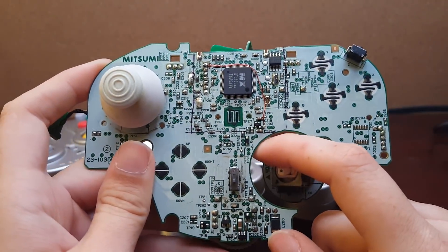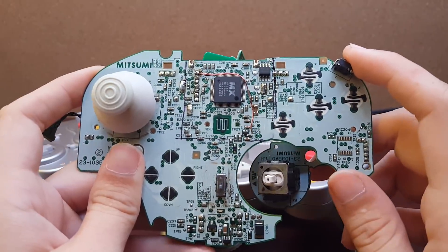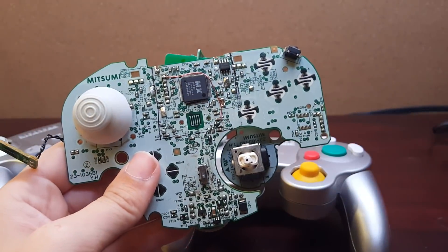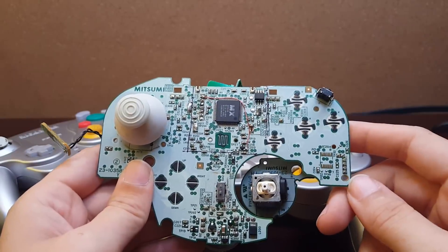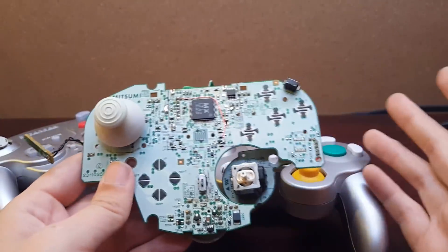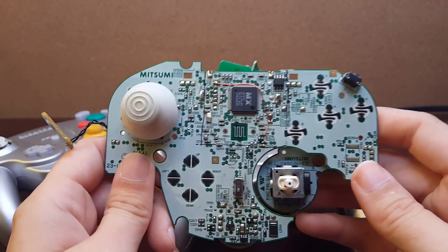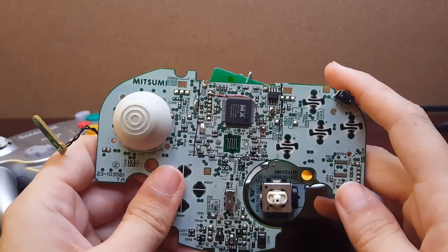I am pushing the very limits of what the WaveBird can do, deliberately trying to break it to find out its limits. I had a WaveBird where I removed every single capacitor on the board except for the two that go to the crystal resonator on the back, and it worked fine for months — it never broke. I finally decided there was no point continuing because it just refused to die. It never had any interference issues; it should have had some kind of issue but it didn't. The hardware is just so solid that you can remove a whole bunch of stuff with no ill effects.